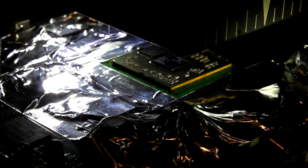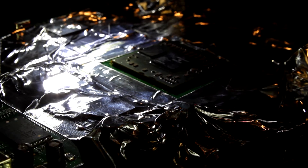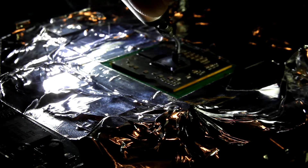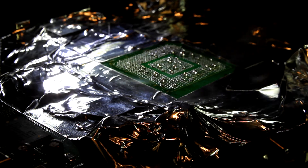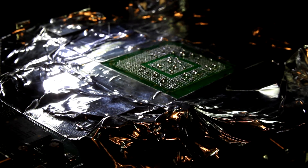We're at 216 degrees Celsius, and I'm just going to nudge the chip — it's ready to go. I like to twist them just a little bit like that, and that's it. I turned my top heater fan on to let it cool, but I'm going to let the motherboard cool itself down.